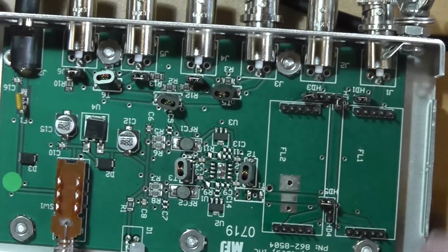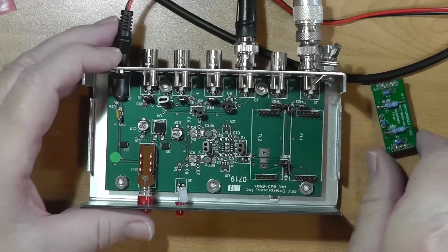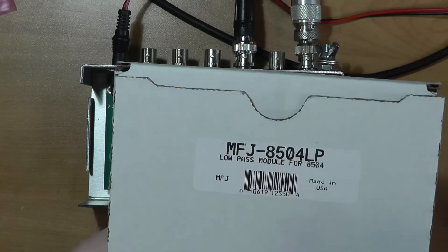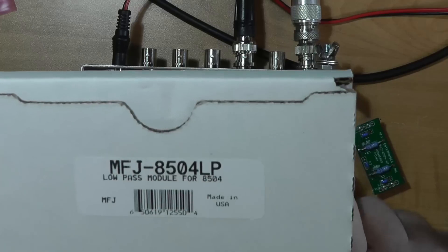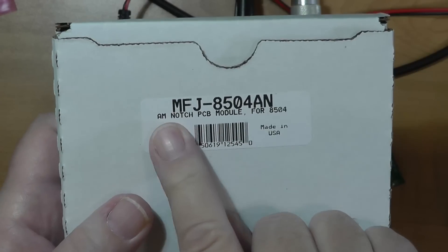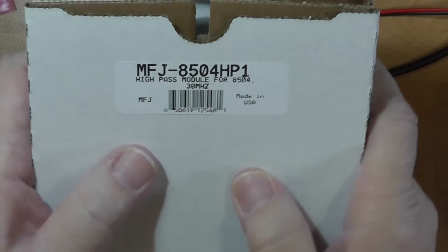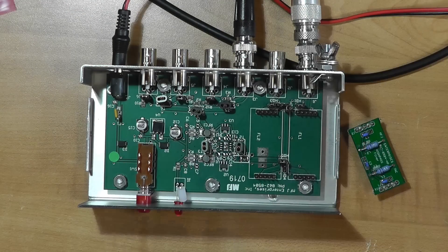Things that you do in here, unless you do something stupid, won't invalidate the warranty. There are different filters: this one is a low-pass filter, so anything below 30 megahertz it will pass — you might want to put that on your HF antenna. And here is an AM notch filter. If you're having trouble with AM broadcast stations capturing your receiver and you're close to some transmitters, here's one you can put in. And then there's a high-pass filter for anything above 30 megahertz, if you just want high band and low band.